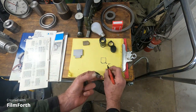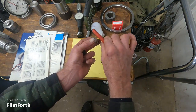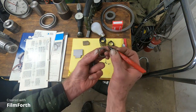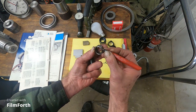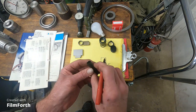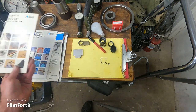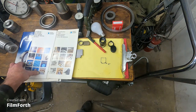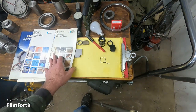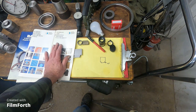Push on the number side; don't use a socket — make the right tool. A two-degree face on the outer edge contacts right on that radius and pushes the bearing in cleanly.